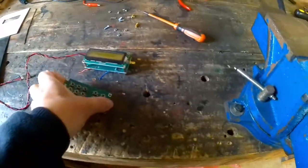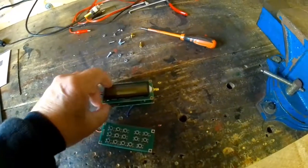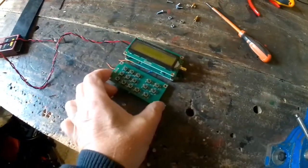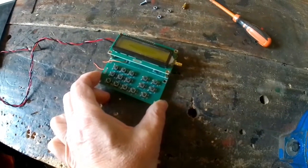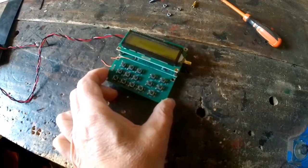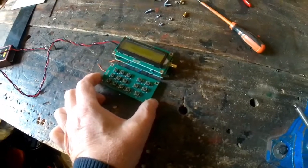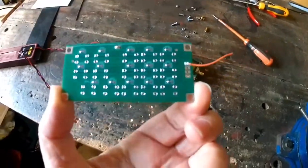It's a single chip device. When you get them, you don't get a case, and it runs from USB. This board is actually connected to the main board — they're made as one board. The problem with that is it's really awkward to make a case for, because you want the switches positioned a certain way. I worked out you can actually cut this board off without upsetting the electronics if you're very careful, and that's what I did.